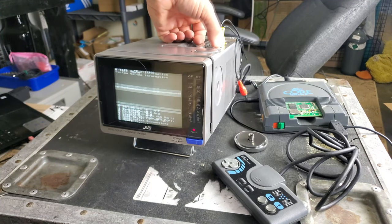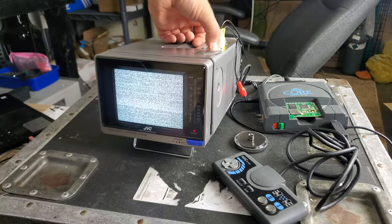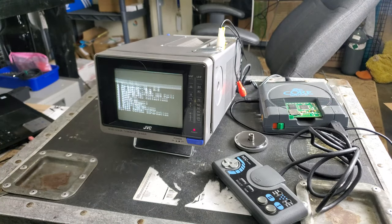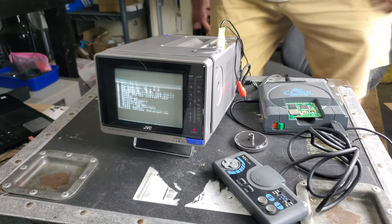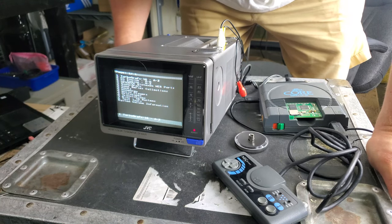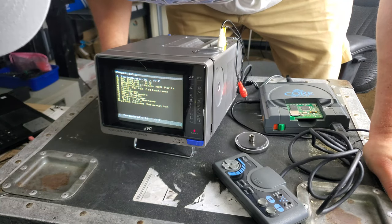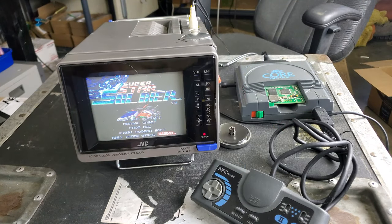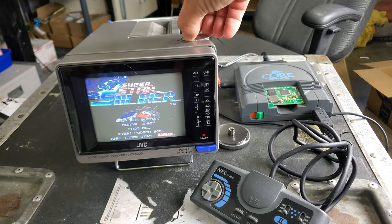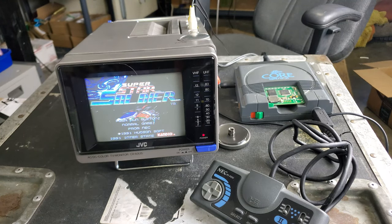You can hear it — but there's a hold issue and none of the buttons are pressing or working anymore. Is there a V-hold adjuster on it somewhere? There it is. Now there is color — there we go! It does work, we've even got volume. Thank goodness for that.